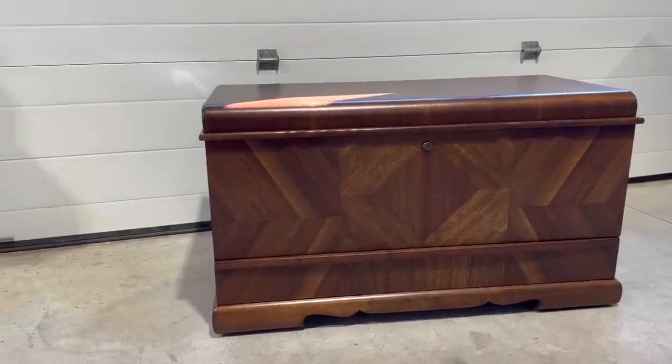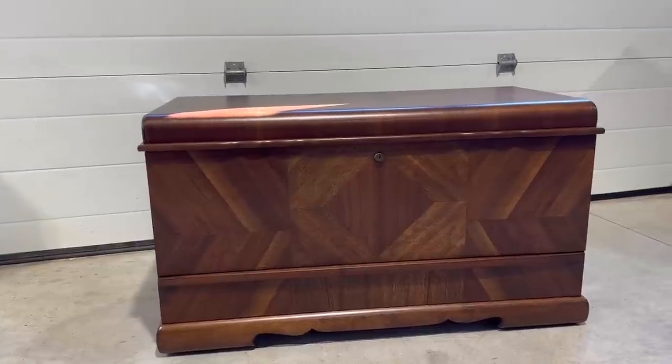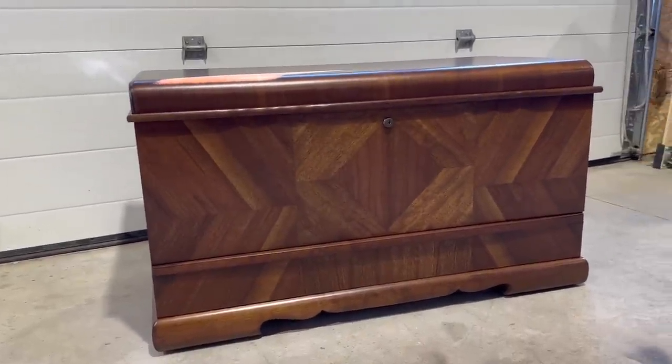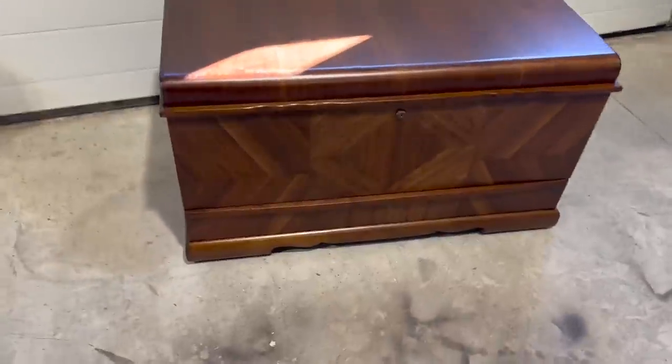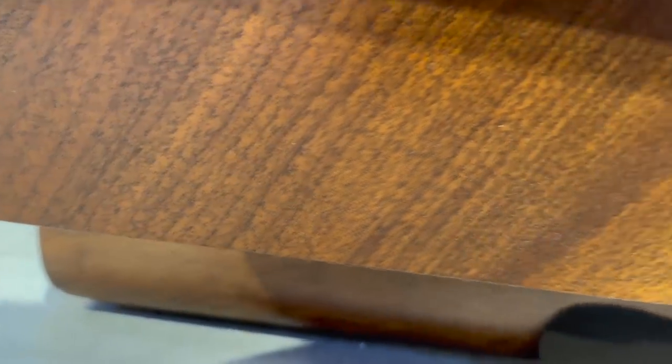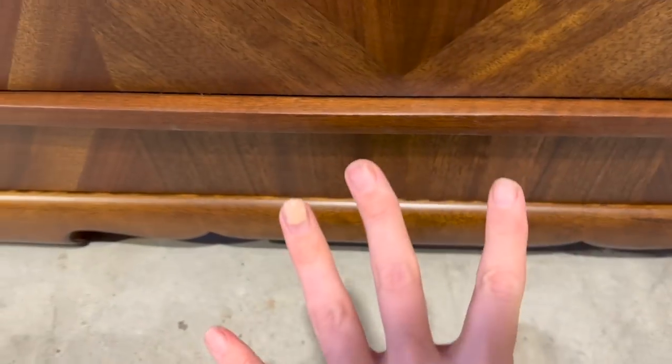And there it is, all finished up and looking nice and neat. All its veneer back in place, nice and clean, a good finish back on, and the color looking nice and original. So you remember all our repairs on the top. We had a couple of little veneer repairs, mainly the one on the side here, not noticeable now. We did have quite a few veneer repairs on this drawer along the bottom. So looking really nice. And of course we did new cedar veneered plywood inside, rebuilt the whole drawer, whole new finish.